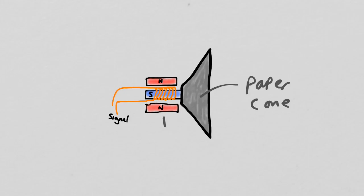We can send a signal through that orange coil, and the signal will vary its direction and the size of the current as well, and that's going to change how much it vibrates and in what direction it vibrates. And that's how a speaker cone works. Yeah, it's just a coil of wire attached to a paper cone inside a magnetic field. Send a signal through there, it will vibrate the speaker cone, which will vibrate the air, or cause pressure waves in the air, which we can pick up as sound waves. Okay, I will see you in the next video.